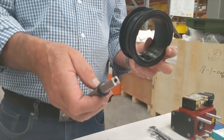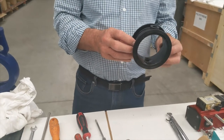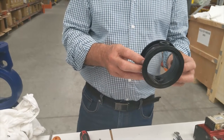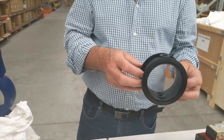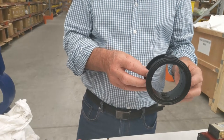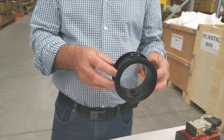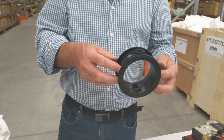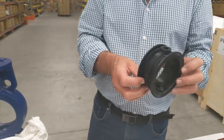This really is the heart of the liner. It's available in materials such as EPDM, nitrile, hypalon, Viton, and epichlorohydrin — a whole range of different materials. But the standard that we carry is EPDM, which is benzoyl peroxide cured and has a top working temperature of 130 degrees C continuous. It's also very good with water — it's FDA approved for use on water.